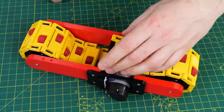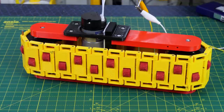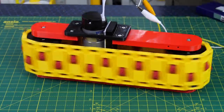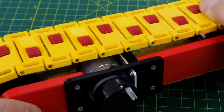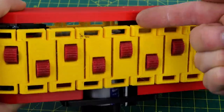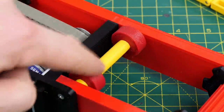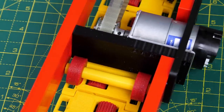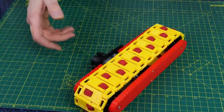Now we can put the other side on which screws onto that motor mount in the middle to hold everything nice and square. We can loop that track all the way round and after a bit of a fiddle put some extra pegs in to attach the two halves together. The track isn't as tight as it could be but I want it to move freely and that motor to be able to drive it without too much load. Putting a battery on it, it seems pretty good and runs pretty smoothly — it drives backwards and forwards. I'm a little concerned the little wheels might hit the motor bracket, so I've installed two little bogey wheels which are basically idlers fitted at the bottom to hold the track away from that motor bracket. Those are TPU with some spacers and another 3mm axle. It slides sideways pretty well so I'm really happy with that.